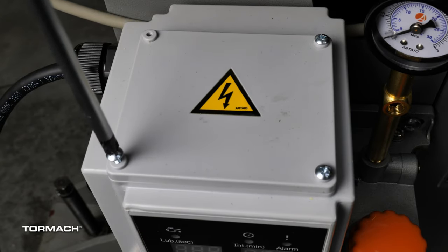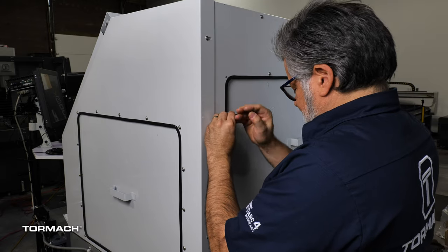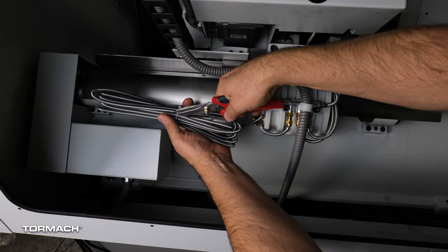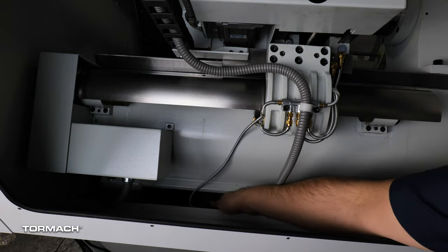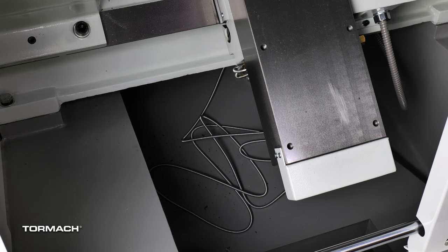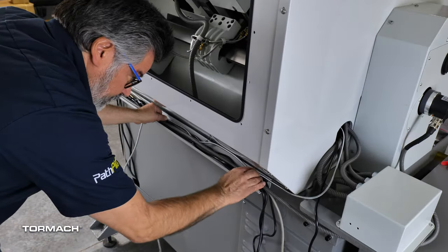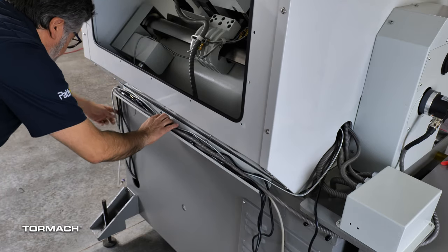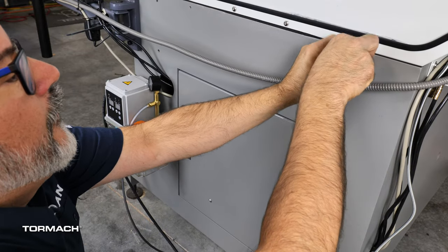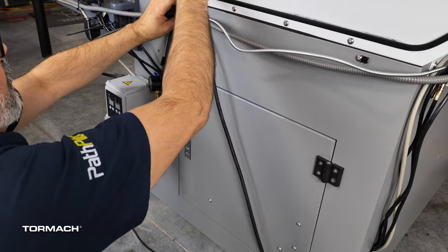Replace the cover. The oil line to reach the automatic oiler is inside the enclosure behind the rear back panel. Use a 3mm Allen wrench to remove all the screws and remove the panel. Snip off the wire tie holding the oil line bundle together and slide the line into the enclosure stand. Fish the plastic strapping tape through the side casting hole and into the chip tray. Tape the oil line to the strapping, then pull it through the casting and out the side. Lay the oil line on the rear wire trough, ensuring there's plenty to reach the oiler and give freedom of movement inside the chip tray. Secure it with wire ties and snip off the excess. Attach the two wire tie mounts provided with the kit to the side of the stand with M5 screws and an Allen wrench. Both the e-stop cable and the oil line are attached to these with wire ties.